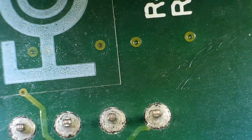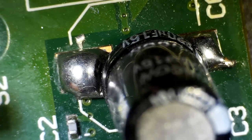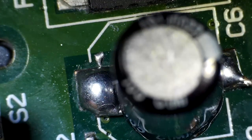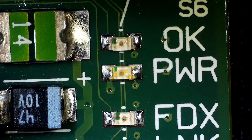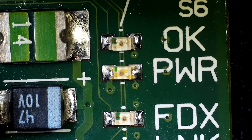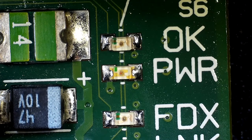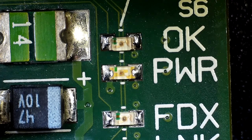this, so that's me scratching the board there to look at the layers of gunk on this, even on the top. This is a big capacitor I soldered on. It's not surface mount, but it works. I just bent the legs and cut them off. It was a capacitor I found somewhere on another board, so whatever. These are the power LEDs. And I think the Raspberry Pi 1 only has Ethernet LEDs, which you see below, and I don't have Ethernet plugged in, so we won't see them today.